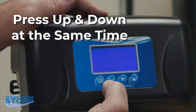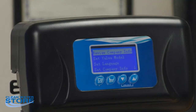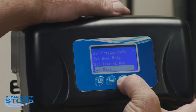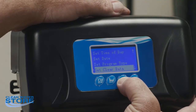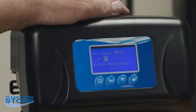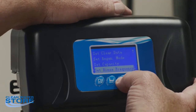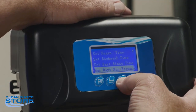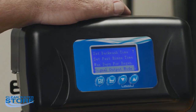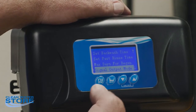To enter the second level, plug in the valve and hit the first, second, and third buttons together. The screen looks similar to the first programming level, but this time you have options like language, hour mode, time of day, date, program types, and regen modes. The program type and regen mode are the settings that define whether this is a filter valve or a softener — do not change those. Capacity, backwash times, and similar settings can be adjusted here as well. Refer to your startup guide if you want to explore these.